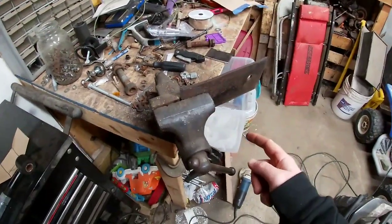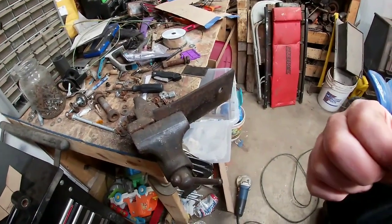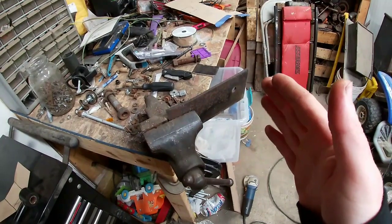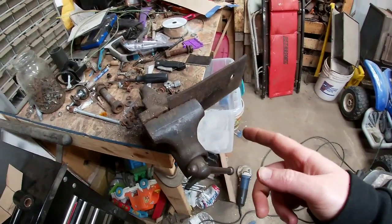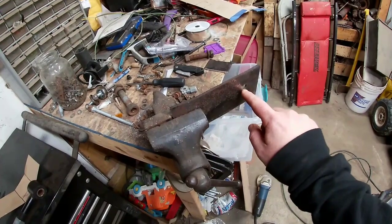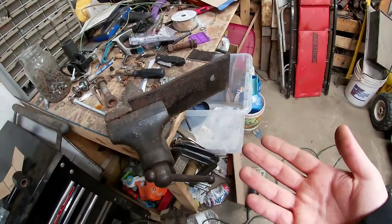Cut them off, and then we will clamp this onto the C-notch on the truck, and then be able to figure out what angle, measure everything, make sure everything's symmetrical, and then fully weld it, figure out where our holes need to be, which hopefully we can actually be able to use this one because that would be cool. Otherwise I'll end up just filling it in. But we're gonna go ahead, measure, and cut.